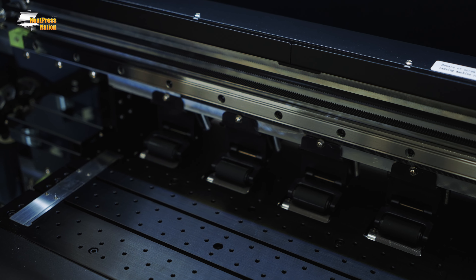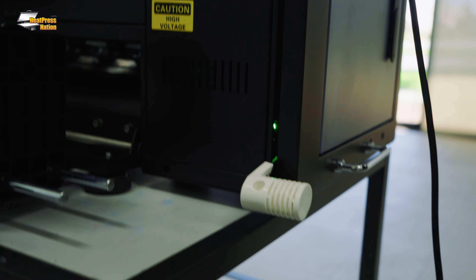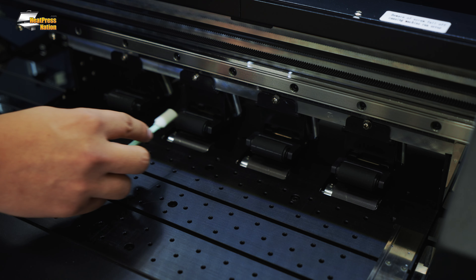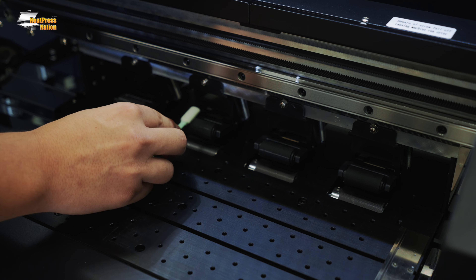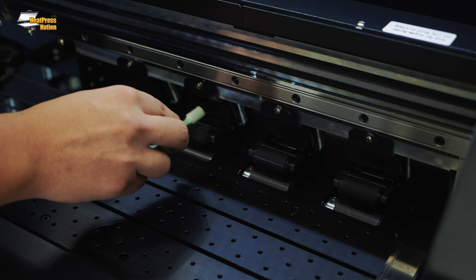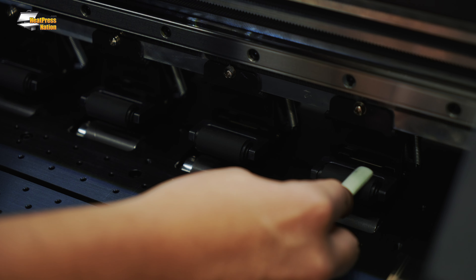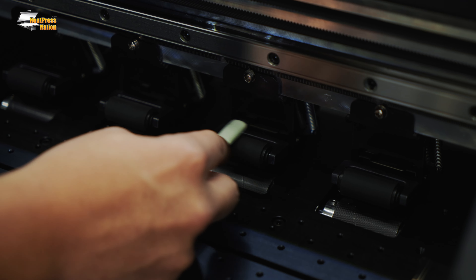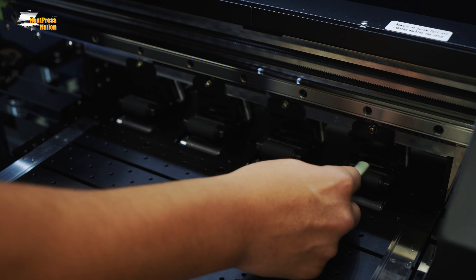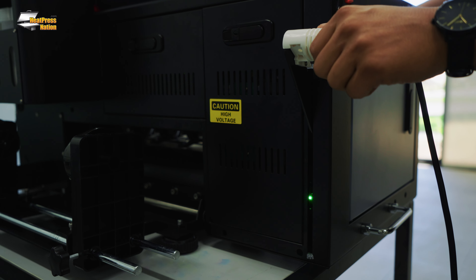The other weekly maintenance is cleaning our pinch rollers. If you can see, there's a little bit of buildup on the actual pinch rollers. To lift them, pull this lever up — it's going to lift the pinch roller. Take one of your swabs and go ahead and clean this off. We don't want to be too aggressive, but we don't want debris or residue on here. It's really important that we clean all of these — if you ever notice markings on your film, it's typically a dirty pinch roller. Then put the pinch rollers back down.